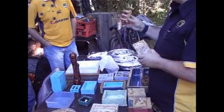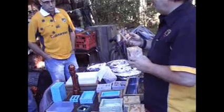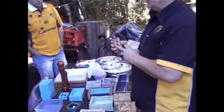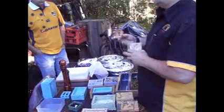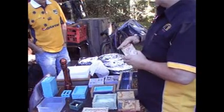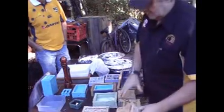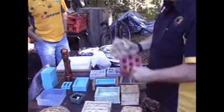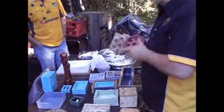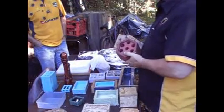This is just basically a weight that holds whatever you're casting down to stop them floating away, and that's made with dowels, and I actually coated it with a bit of silicone so they don't stick too well. You'll find a little bit stick on, but they don't stick to the casting. And then I just put a weight on top of some description, so that really just sits like that on top of the units. This is the Barnes super hot, heat resistant silicone, very stiff, doesn't deform at all, and that will last a lifetime.